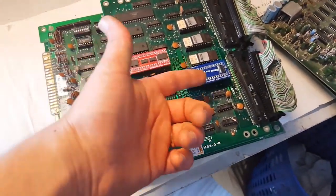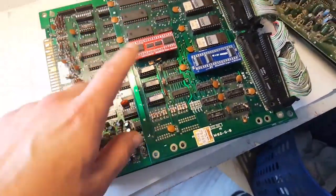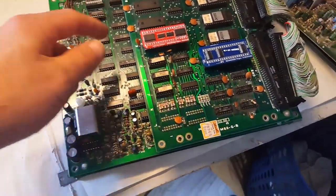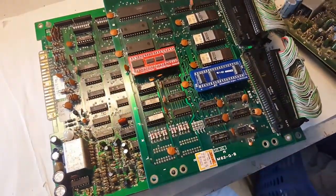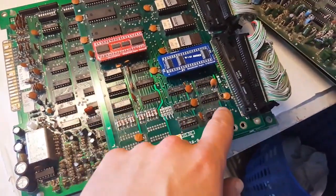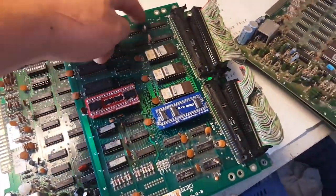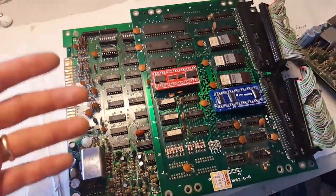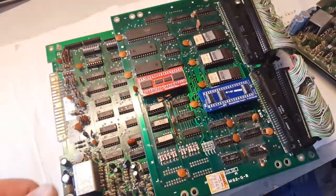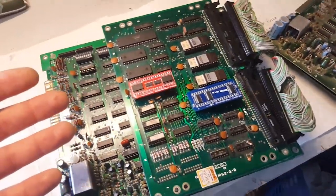People thought I was replacing or re-burning new ROMs into these things, which is not at all the case. These custom chips are essentially integrated TTL logic — one of these chips contains many discrete TTL gates. It just obfuscates the working of the board a bit and makes things smaller and tidier.